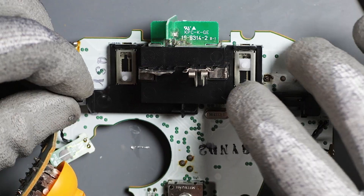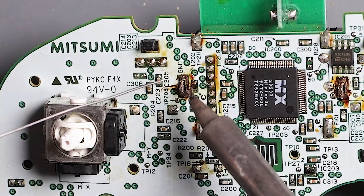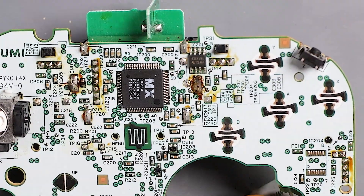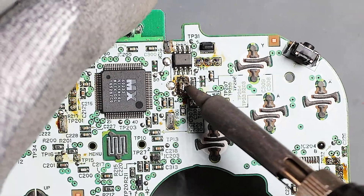Reinstall the plastic piece and make sure it's flush to the board, then solder it back in place. From here you can see this lead did not stay on this side of the board — it fell out. To fix this, heat the solder and press the board down, then it will seat itself properly.